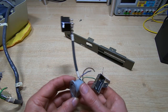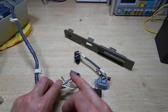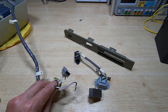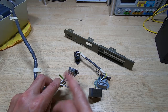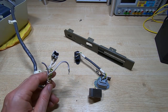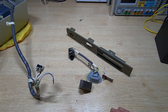While I was doing this I also found some other issues. One of the leads had broken off the main switch — almost certainly it did that when I was taking it out — but it looks like there was only one or two strands holding it on, and it does have mains on this, so it's perhaps as well that it snapped when it did. I do tend to examine these anyway and look for anything that's likely to fail. If it comes off and touches something it can do a lot of damage. I'll get this rebuilt and then refit it to the lower part of the chassis and start to reassemble the entire unit.